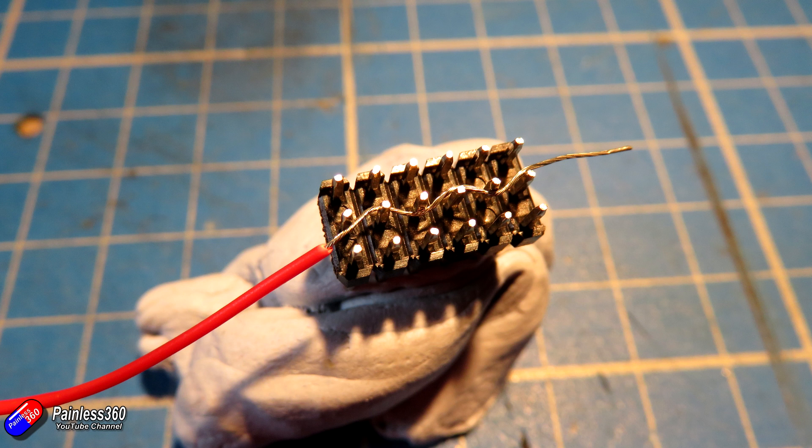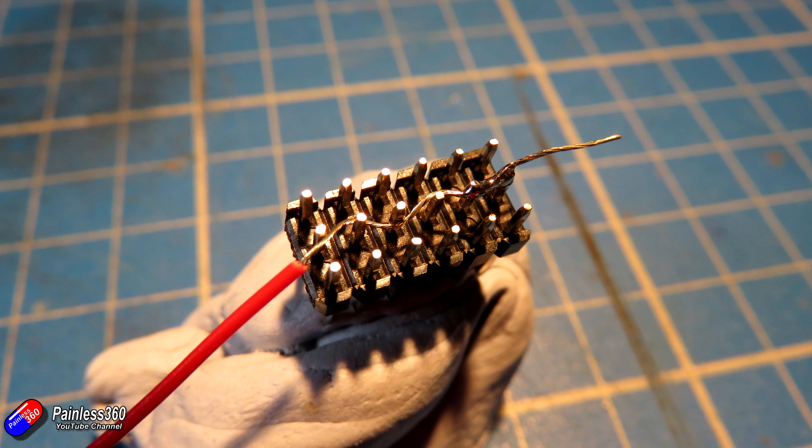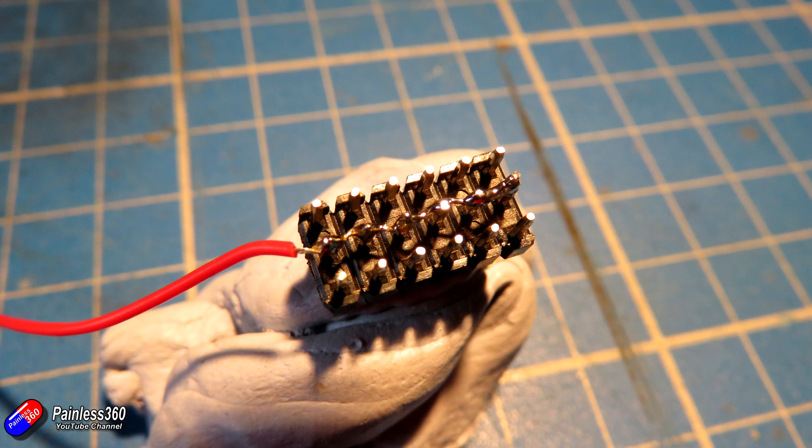You can see how I've just woven these strands together. What I'm going to do is just very briefly with the tip of a fine soldering iron, put a little blob of solder on each, starting at one end and working my way along. It doesn't take much heat at all. I find that holding it in something like a blob of Blu-Tac is very good to make sure that if you do get a little too much heat in the pin, the pin doesn't deform and move around in the plastic support. That's all of the red connections, plus 5 volts, done.